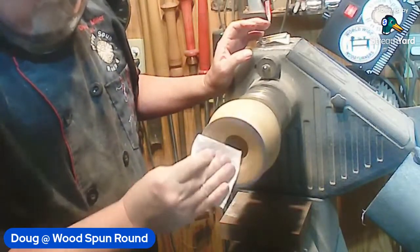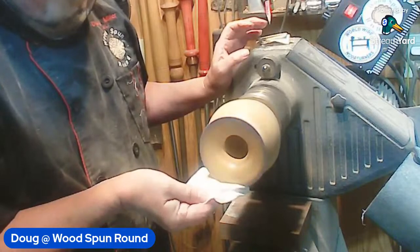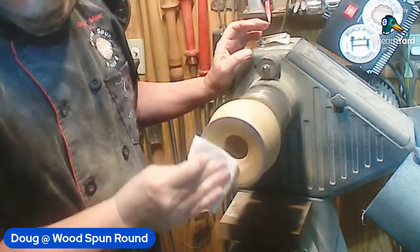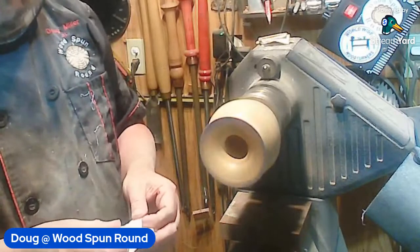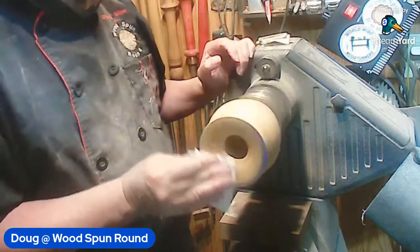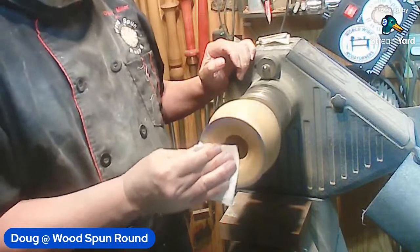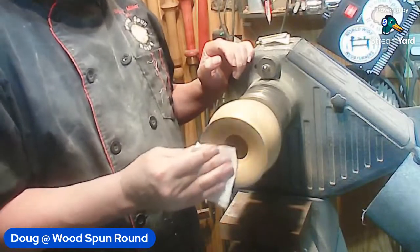Now, when people are finished with their abrasive paste and they usually put on their final wax in order to give a final coat to their piece, the biggest mistake they seem to make is that they don't let it dry first and then buff it. Yes. Mark, it seems like you were in on that part of the conversation when Martin was on the first time as one of Steve's earworm or special earworm, and he said not to wait. But yes, I think you're right, Ruby. Wax, most waxes at least, need to sit at least a few minutes.